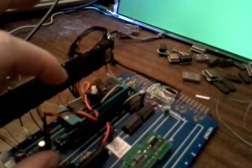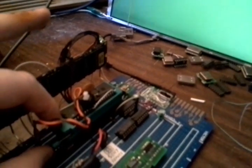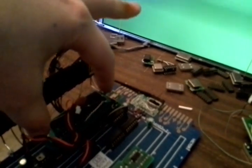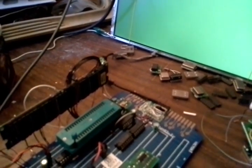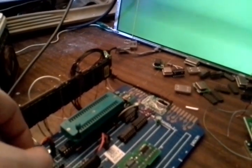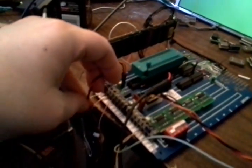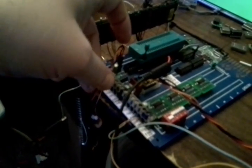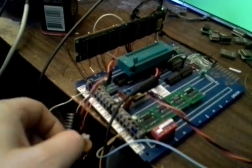So there's my processor. I pushed the reset switch, and so I should be able to remove it from the socket while it continues to refresh. There we go. And I made this mistake last time, which was to leave it dangling there where it could short out with something. So let's not allow that. It's snagged. That's even better. There we go. Okay.